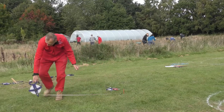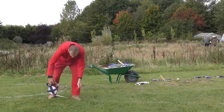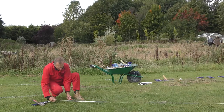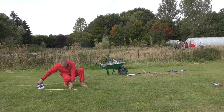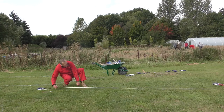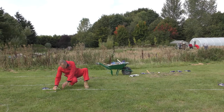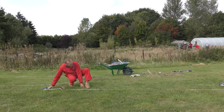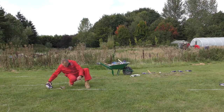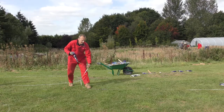So what I'm going to do is measure 4 metres and 3 centimetres along and knock another peg in. Pull that across there — I've got to my 4 metres and 3. Check your tape, give it a little pull up and down to make sure it's nice and solid, then knock your next peg in. So now you've got that at your 4 metre mark, or 4 metres 3 centimetres in my case.